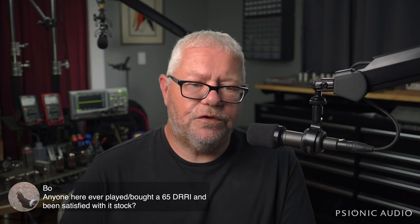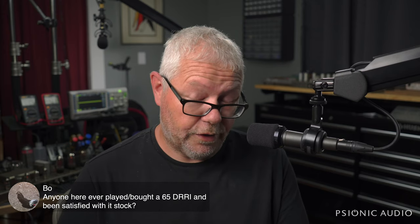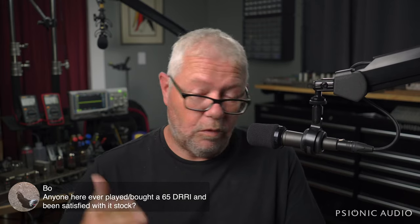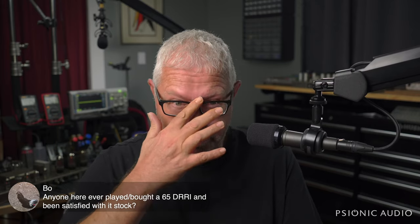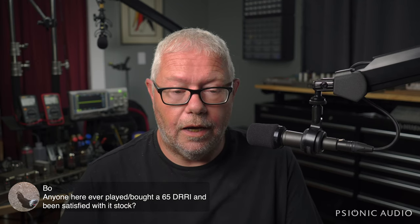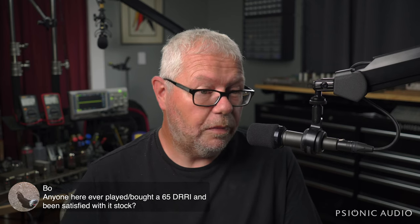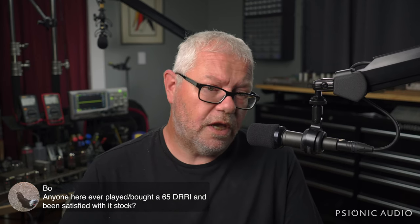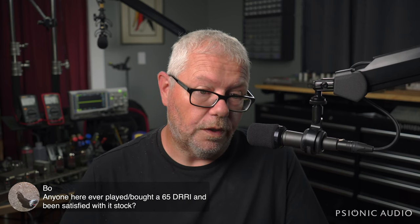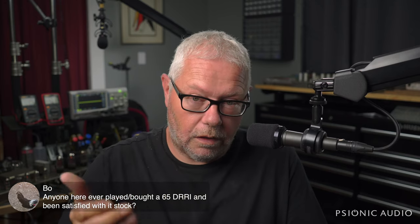The 65 Deluxe Reverb reissue in stock form usually sounds very good while everything is working well. Many of the changes I make to that are to keep it working well, moving the stuff that gets hot off the PCB, putting in filter caps that someone would choose to use. The only downside to the stock one, as it comes from the factory, if it's biased correctly, is that the vibrato channel is a little bit noisier than it should be just due to how a trace was run, and it has a 47 picofarad bright cap, which can be a little bit harsh.